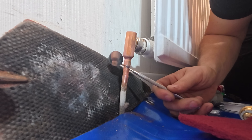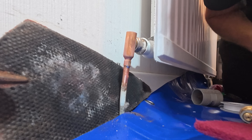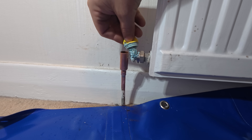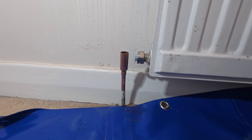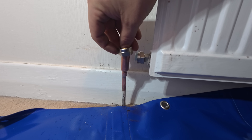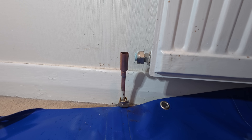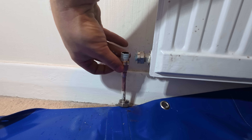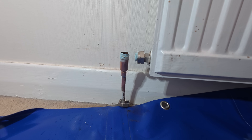I'll give it a little inspection around the back — that looks pretty good, I'm happy with that. Just put a bit of paste on this front face of the olive, then put the olive on our new fitting, give that a run around — that helps keep the other olive in place — and then once more. That's perfect.